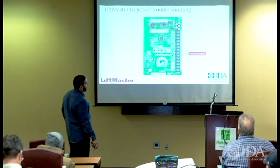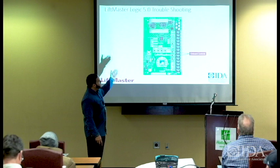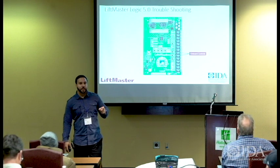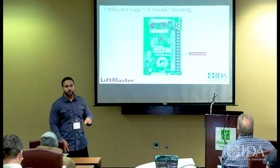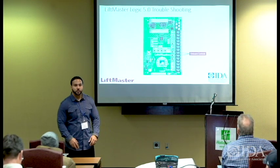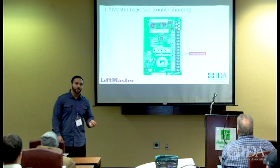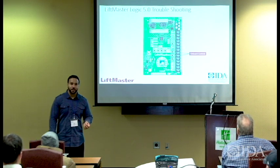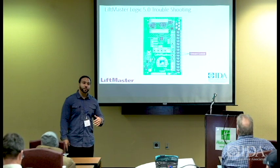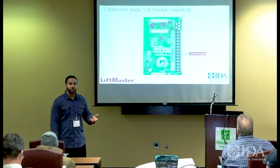And the reason is without that there, that voltage does not trickle down. So you can push those buttons all day long. If you do not close off the common and the stop circuit with a jumper, then that unit will not run. You got to remember to take that jumper out though whenever you put the 3-button station on or the key switch on there or the key switch with a stop, because if you don't, you're never going to get your stop button to work, okay?